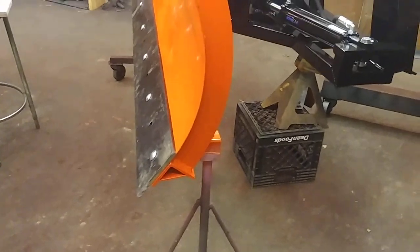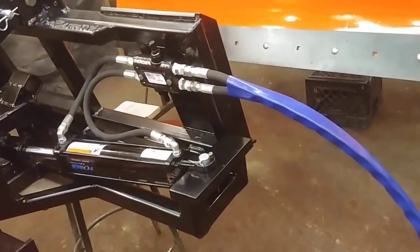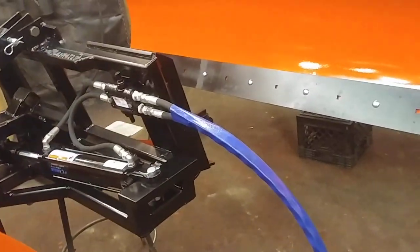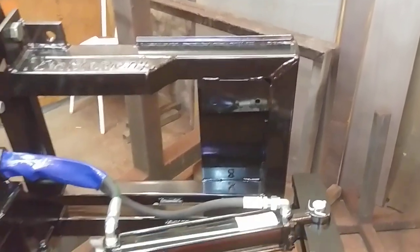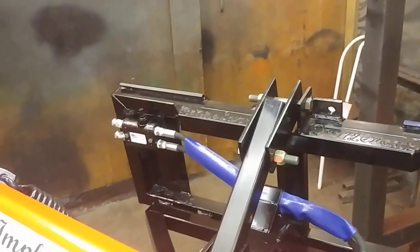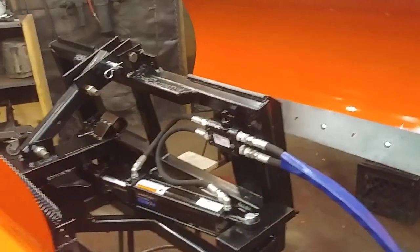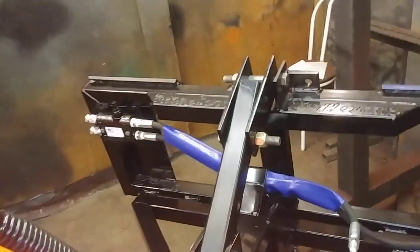So that's just some of the differences. On the plow here, you'll also notice the crossover valve is on the opposite side from the cylinder on one, whereas on the other it's on the same side. The reason for that is we standardize all of our central frames now. We had been flipping the cylinder from one side to the other, but that makes a nightmare for inventory. So now what we try to do for all of our inventory faceplates is put the plate in on both sides of the faceplate. Then if the customer has a utility tractor where their hydraulics come down the right-hand side rather than the left, we can just cross-plumb the cylinder to the other side. That makes it a lot more universal for the customer as well—if you're using this plow on a skid steer for two years and then buy a new utility tractor, you just have to change these two lines from the cylinder to the cushion block, and you can swap your hydraulics to the opposite side of the machine.